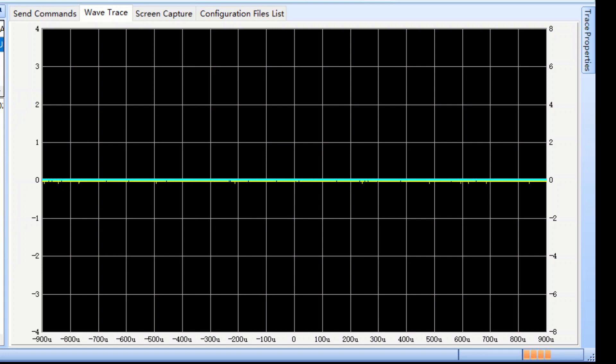The DSP is probably setting up some other internal settings unrelated to volume — some sound manipulation. So I cut the trace from the signal line to the DSP. What I found when I put the scope on: the blue line is resting at zero, so I believe that DSP is faulty and it's holding the line up above ground.